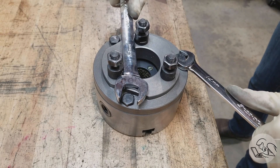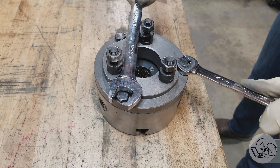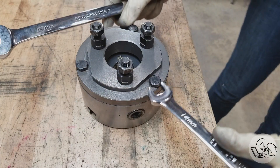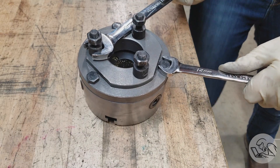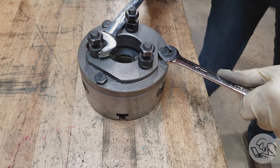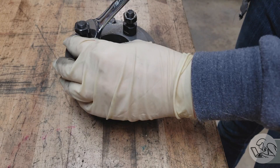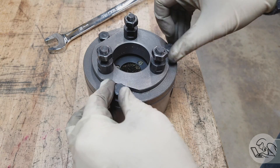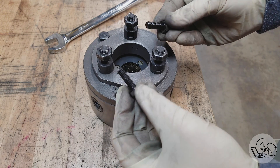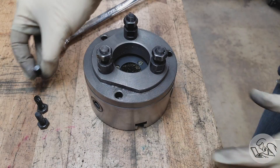With the jaws out we can remove the backing plate next. This three dowel pin system here is how the chucks mount on my particular lathe, but if you buy a new chuck it may be plain backed, and the plain back is underneath this backing plate. Holy mother — those bolts were tight. Those were clearly rammed on there with an air tool at the factory. As you can see I've never had this chuck apart before. Do as I say and not as I do, and take your cheap import chucks apart when you get them and clean them. Removing these bolts I find the usual foul-smelling used motor oil on them — I think they do it as a kind of free anti-seize.